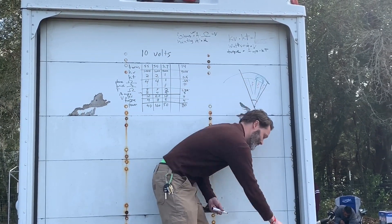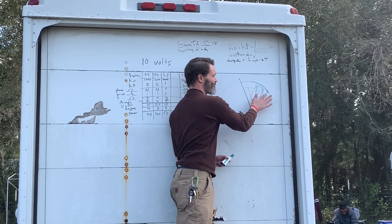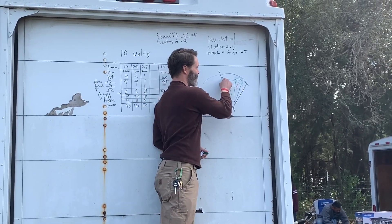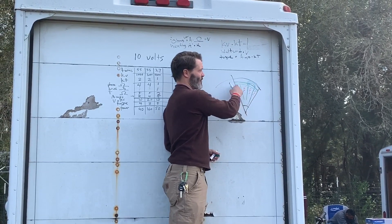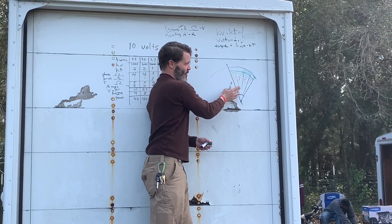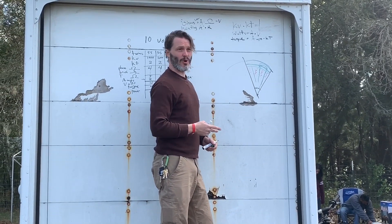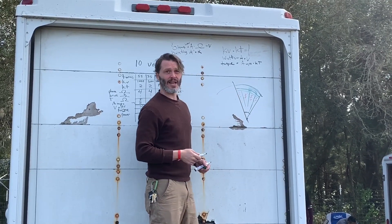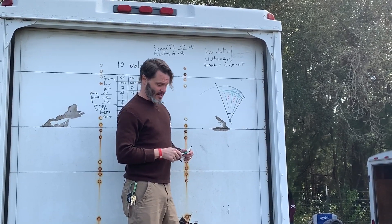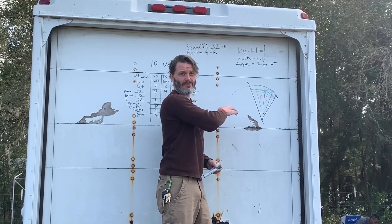When we double our pole count we can actually thin the back iron by half. We have two options: one is to deepen our stator teeth and cut the back iron in half, moving it up, giving more room for copper. Alternatively, we could move the back iron up and the teeth up by the same amount, giving more room for magnets. Either way, doubling your pole count gives you more room for active materials on the inside due to that flux efficiency in the back side.